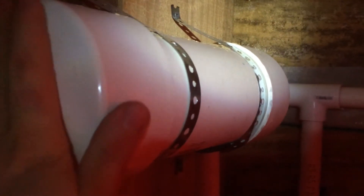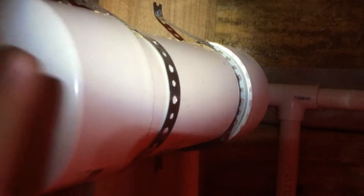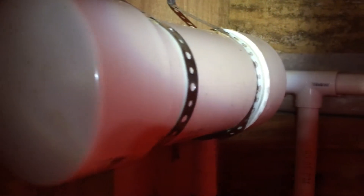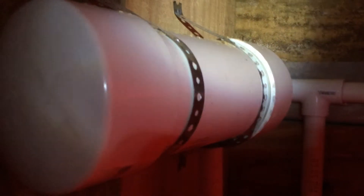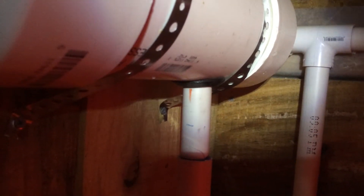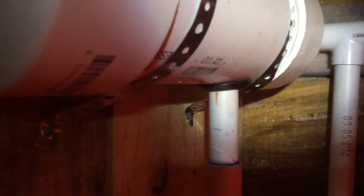This is a four-inch PVC pipe with a cap on both ends, about a foot long. Inside of it is that half-inch MPT thread with the micro float valve sitting horizontally. My incoming water supply is coming in as three-quarter inch PVC. I've got a universal seal there - it's a rubber grommet that lets you put a straight pipe through a vertical wall, works very well.